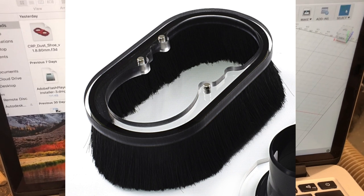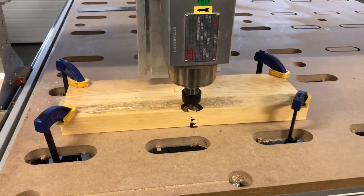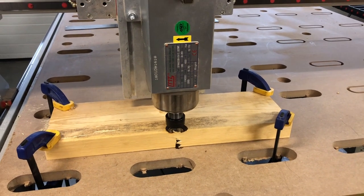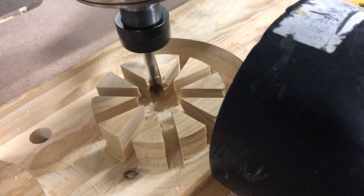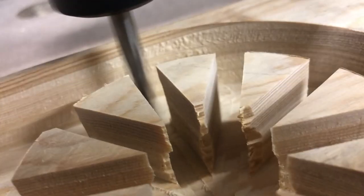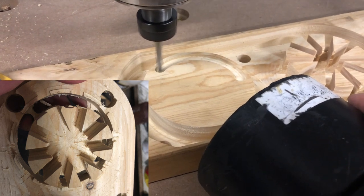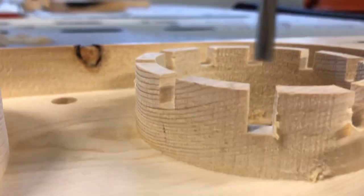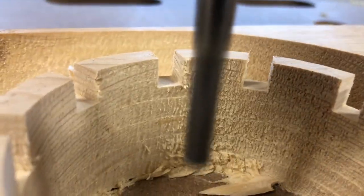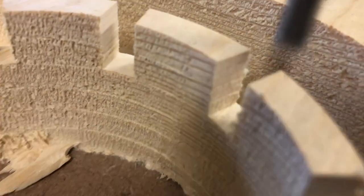There's a secondary part installed using magnets to basically provide a skirt. I figured I'd have to modify their design to get it to work with wood, so I made a prototype part with some minor modifications of their model. The first one I made had wall thickness on the fingers that was much too thin — it didn't even survive the milling process. Those little finger tangs broke off during the cylindrical trim operation where you establish the throat of where you install the spindle. So I redesigned it and thickened those parts up.